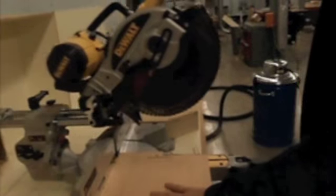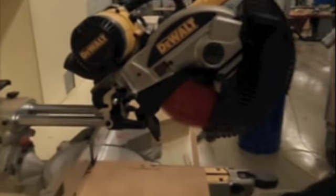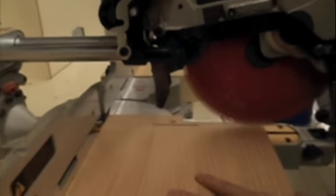With the tool all the way up, she pulls the tool out, squeezes, turning it on with her right hand, slowly cuts through the material down and pushes back towards the fence. Again, out, on, down, and back towards the fence. Make sure you never remove the offcut with your hand. Always remove it with another piece of material.